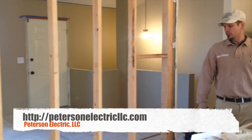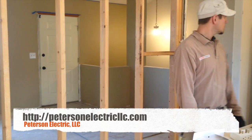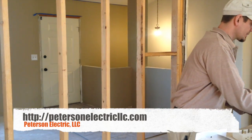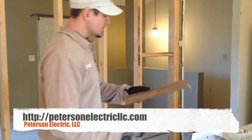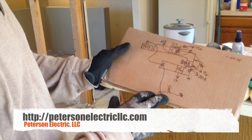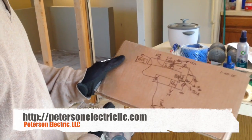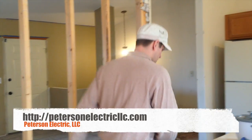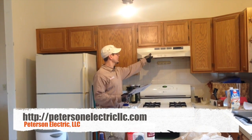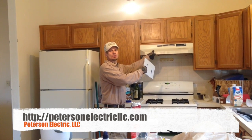So what I wanted to walk through today — we dropped all the wires down after tracing. The first thing I always suggest is to trace everything out. I traced out the kitchen because in the future he's going to do a kitchen remodel. I wanted to make sure the lighting circuit wasn't connected to a bunch of stuff. Normally when I see these light circuits from the 80s, part of that circuit would include a vent fan — one to one-and-a-half amps — and then someone sticks an over-counter microwave on it that draws twelve-and-a-half to fifteen amps.